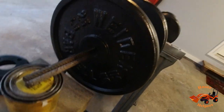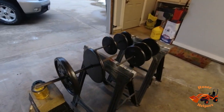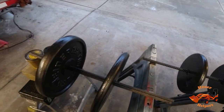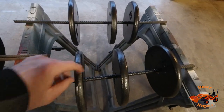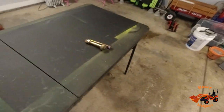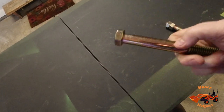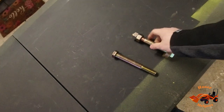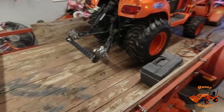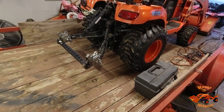We're back and as you can see I've got all these weights painted up, and I think they painted up pretty nice. I didn't take any footage of the actual painting — everybody's seen somebody spray paint something once in their life. I've got my hardware here: a couple of 6-inch long grade 8 bolts — grade 5 would have been fine probably — three-quarter inch bolts, a couple nuts, some washers. I've moved the tractor ahead just enough that I can work on it here. We're gonna go ahead and bolt these up.